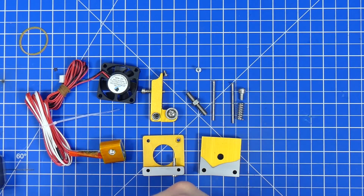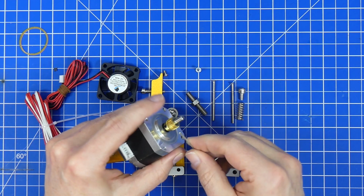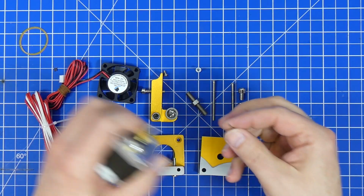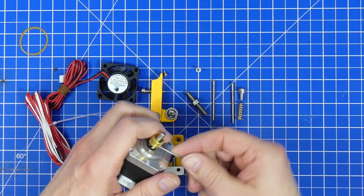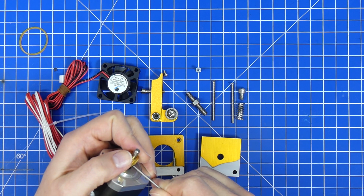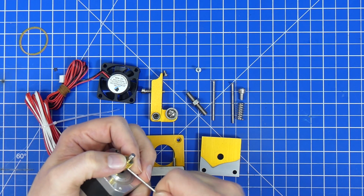And the last thing to do is we need to move the gear on the stepper up by about 2 millimeters if the thickness of our mount is 2 millimeters. So if we have a mount that is 3 millimeters, we need to move it up 3 millimeters, of course. And I'm going to do this before putting it back together, because it's pretty hard to get in there. And surprise, one of the screws wasn't tightened down. Why am I not surprised?